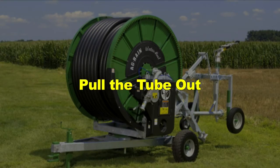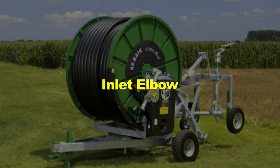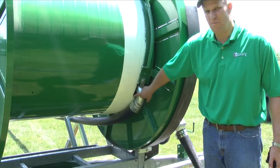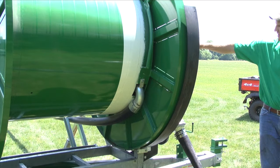If this is the first run of the water reel, you must verify timing. On the first run of the water reel, you need to pull the tube out 100% to verify that your machine is in time. This is the only time you pull the tube out 100%. Once the tube is pulled out all the way, verify that the inlet elbow is at a 45 degree angle behind the axle center line at the bottom of the spool. Be especially careful not to pull the tube off the elbow.